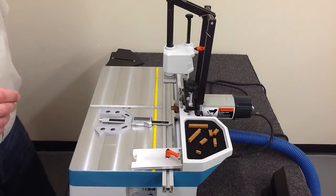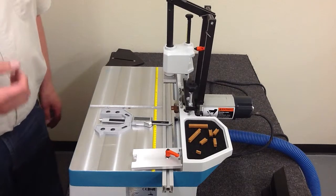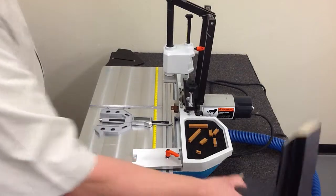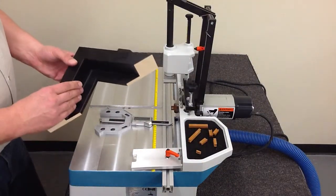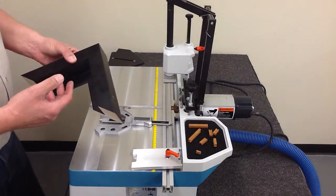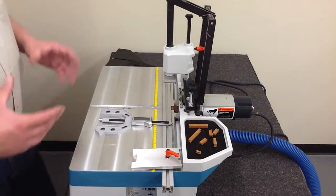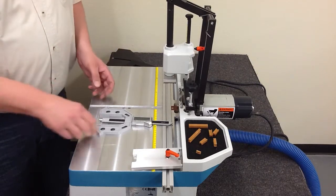Just like you need to adjust the motor back to take some of the pressure off the joint on thin molding, you also have the option of bringing the motor in a little bit on thicker material. If you get into really heavy stock, I have a sample here of a heavy floater frame that we joint with 2 keys. On something like this, we could bring the motor in about 0.1 millimeter and increase the draw and the tightness and strength of the joint.